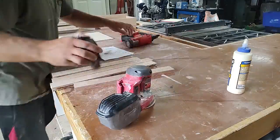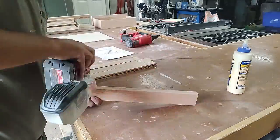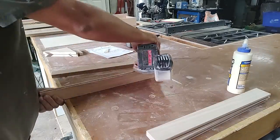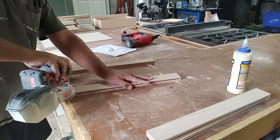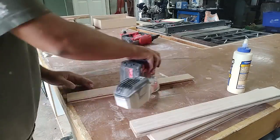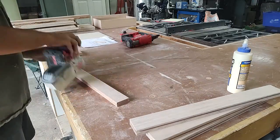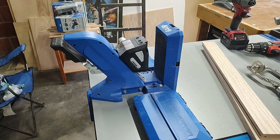While the drawer is drying, lightly sand all of the cut wood pieces you've already cut. We use 80-grit sandpaper first with an orbital sander — just a real light sanding. We love the Milwaukee battery-powered orbital sander; it's handy because you don't have to be near an outlet. Just do a light sanding on everything and get your stickers off, then move on to the pocket holes.